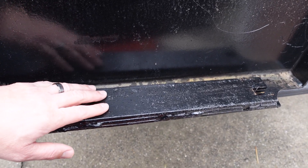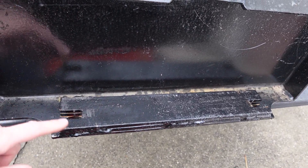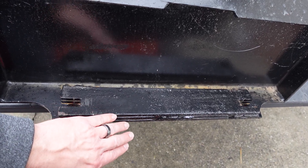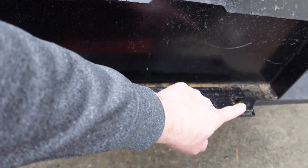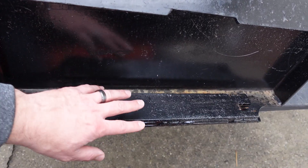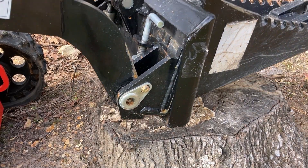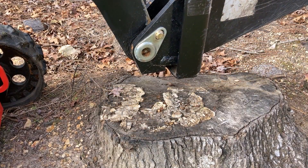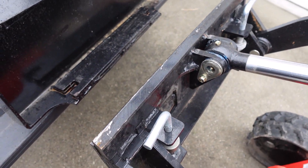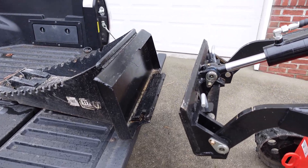What we have here is two pieces of three-eighths steel stacked on top of each other and welded. This is not beautiful steel — there's no telling how old it is, probably 40 or 50 years old. It was in my father's barn; he found it for me and it's a perfect fit with some cutting and modification. The design uses two three-eighths pieces stacked and welded to the attachment. It allows those shoes to go in on both sides, gives meat so the pins can engage, prevents left-right movement, and also shims so it can't move up and down. It's a perfect fit.